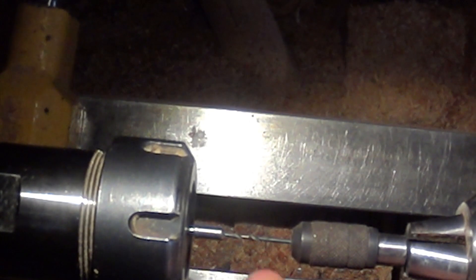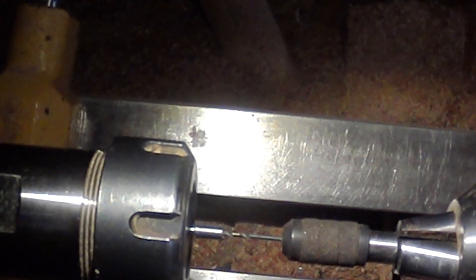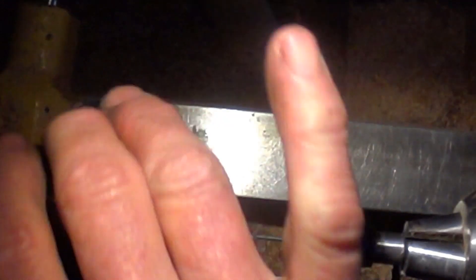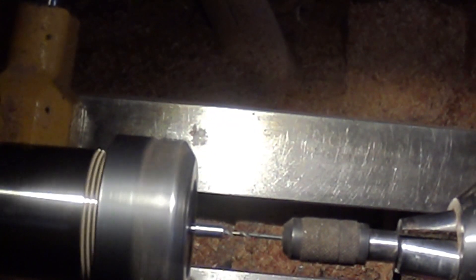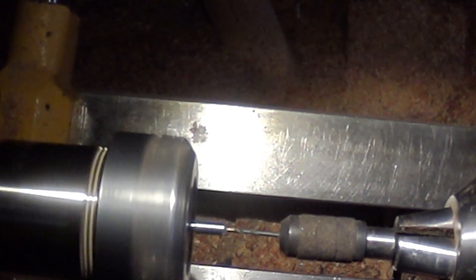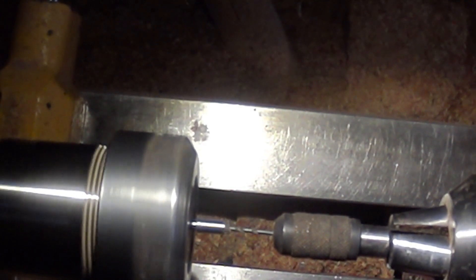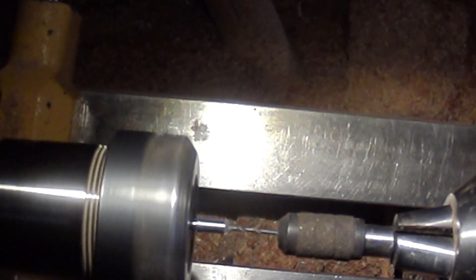The next stage operation is to drill this right up to the end of that wide part, which is about 10mm. I've marked the drill and I'm going to start with the drill already in the hole because this is only a 1.2mm drill. It goes in — I'm only about 2mm short so I'm only looking to drill about 2mm more. I'll go in an extra millimetre — it won't hurt. There we go. Now we've got a nice hole for the lead to get as much lead in there as possible. I'll need to put it in the Jacobs chuck since I haven't got a collet to hold that.